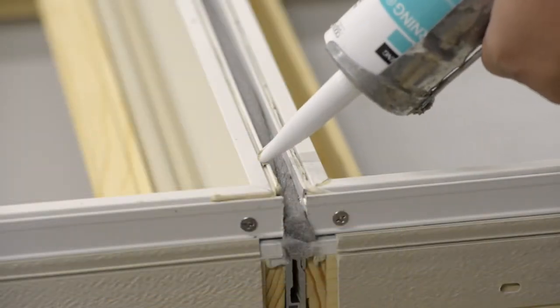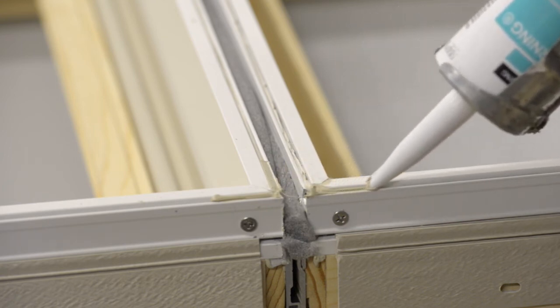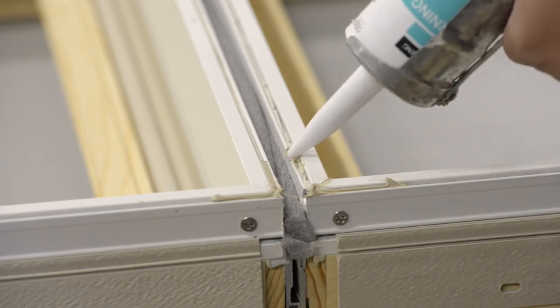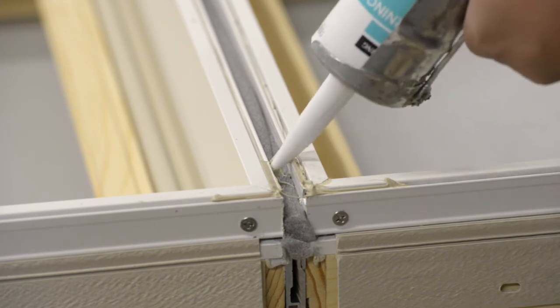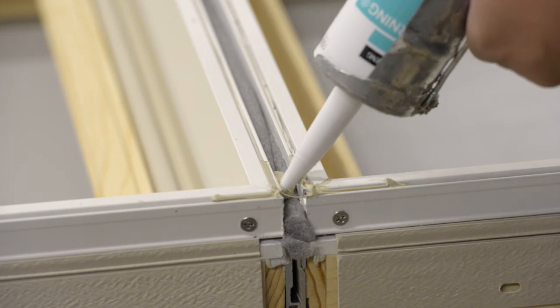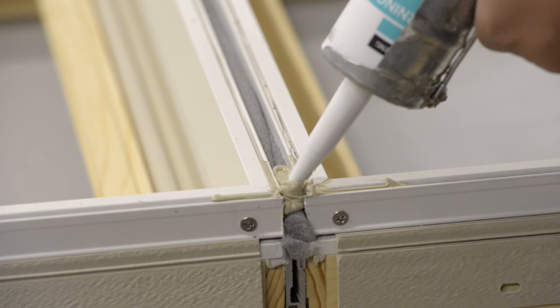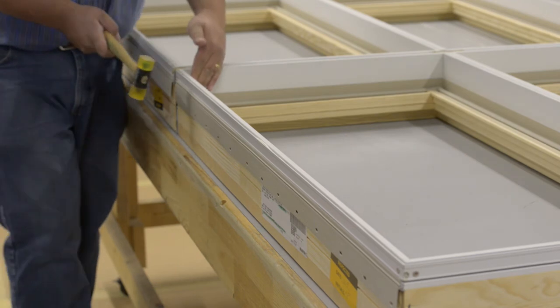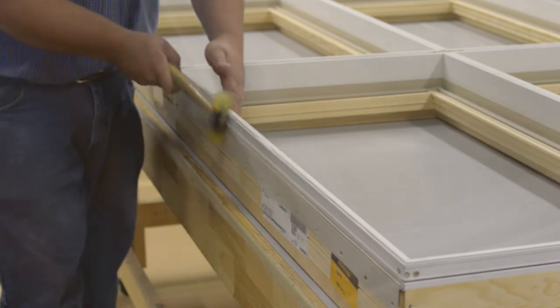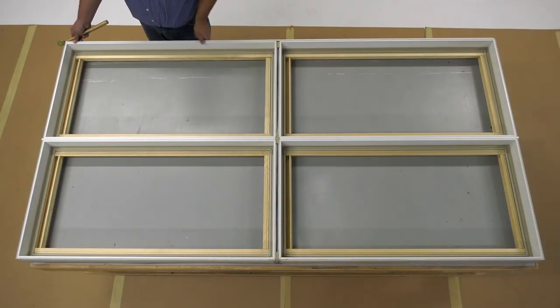Apply sealant about 2 to 3 inches long on each end of the mull and at any intersections along both edges of the mull. Apply a 2 to 3 inch long bead of sealant on top of the backer rod ends. At frame members perpendicular to the MRF mull, lightly dent the accessory kerf using a plastic headed hammer. Then apply the A148 frame trim and seat it with a plastic headed hammer.